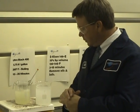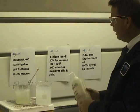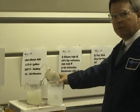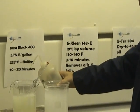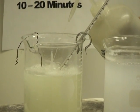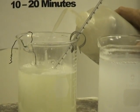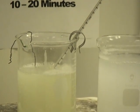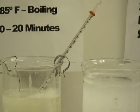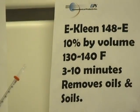One other thing to point out while working with any type of hot black oxide chemistry is when you add water, you must be very, very careful. If you add the water too quickly, as you can see here, it starts boiling and becomes very violent. It's very important that you add the water to the side of the tank very slowly, in an automatic controlled way with a temperature controller device that automatically adds the water to prevent a violent eruption.